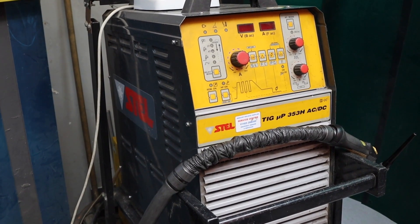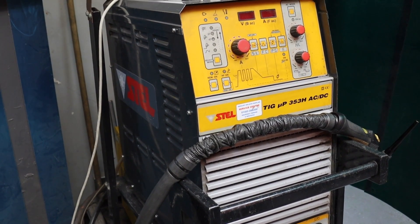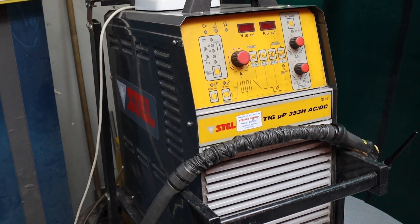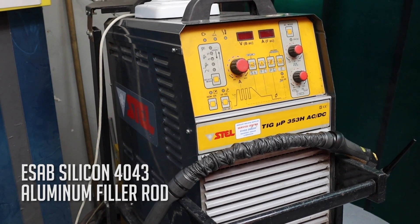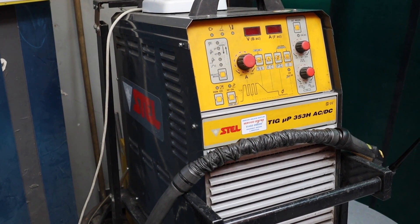This is the TIG machine I'm using today. As I'm welding aluminium, I'm using a zirconiated tungsten and aluminium filler rod which is 4043. I'm using a foot pedal on this machine and I'm going up to 160 amps.